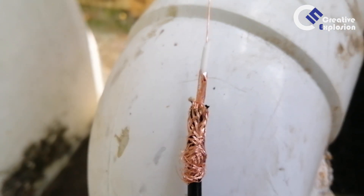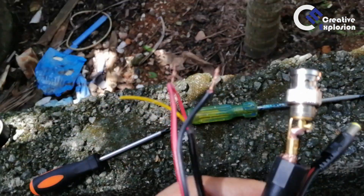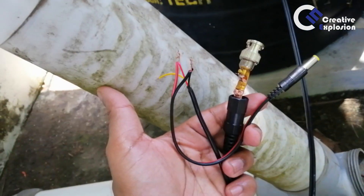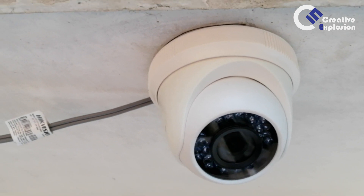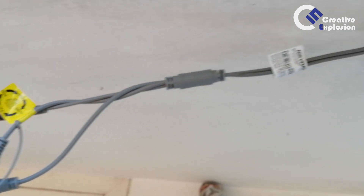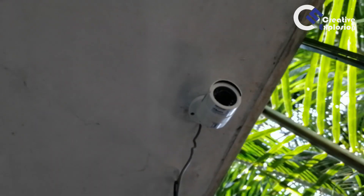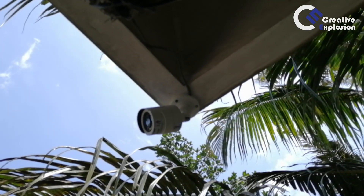Now we are going to set up the camera. This is a BNC connector. This is a DC supply wire and DC connector. This is a power supply. We are ignoring the yellow wire and the red wire. If we are using the DVR and BNC connector, then we will be using IR blasts. The IR blasts are infrared — this is a night vision camera.